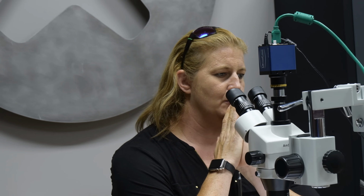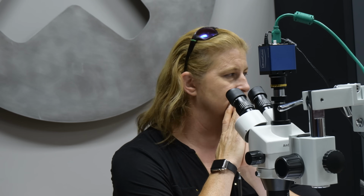So then we would have to say, well, okay, power to the GPU. Why would someone take a capacitor off that line? What problem do you think they'd be trying to solve? They think it's shorted. Yes, exactly. So capacitors, if we looked at a schematic, we could see that they all have one foot on a line and the other foot on ground in general on an iPhone.